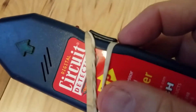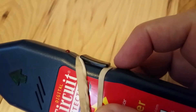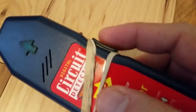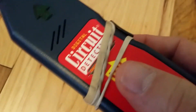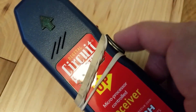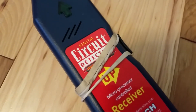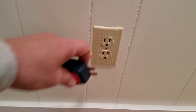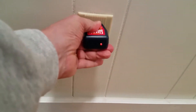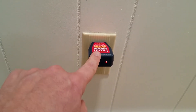By placing a rubber band underneath the lip of the button on both sides, you'll make the button less sensitive, and your batteries will last longer — because if it's in a tool kit or stored where something can bump against it, it'll turn it on and run down your batteries. In order to test this out, you plug it into an outlet and get a tally light letting you know that this unit is energized.